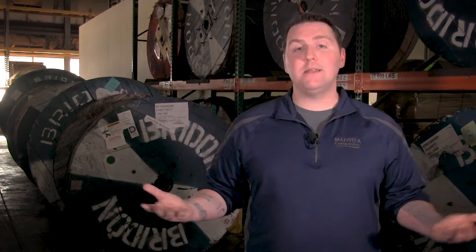So how exactly does your overhead crane get into your building? Well, as Ryan tells me, there's a lot to it. The type of equipment that installers usually have to use to put the cranes in varies depending on the layout of the land, obviously. But if you have overhead cranes available, sometimes you can use those overhead cranes to unload the trucks and put up columns. If not, you've got to bring in a mobile crane. Sometimes you've got to use rigging overhead just to get stuff into place. Lifts, obviously, are part of the job. Aerial lifts, scissor lifts, articulating lifts.